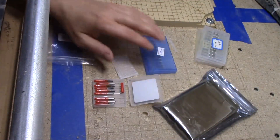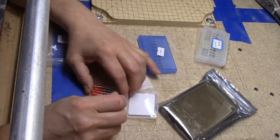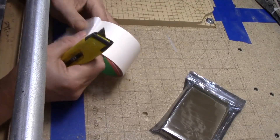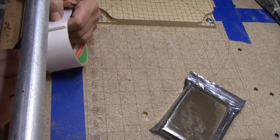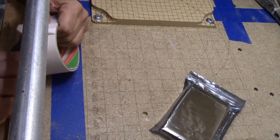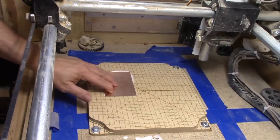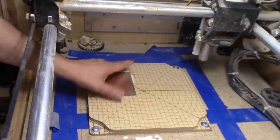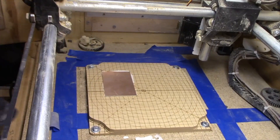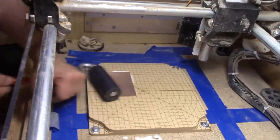The reason I'd like to use the milling bits is that I can drill the holes and cut out the board with the same bit without having to change bits. I've got some carpet tape here. Some people say don't use carpet tape because it leaves sticky messes on the bottom, but I don't have much other adhesive double-sided tape this thin, so we're going to give it a try. The copper is now stuck down on the flattened work area with the double-sided carpet tape, and I'm using a rubber roller to push it down and make sure it's attached.